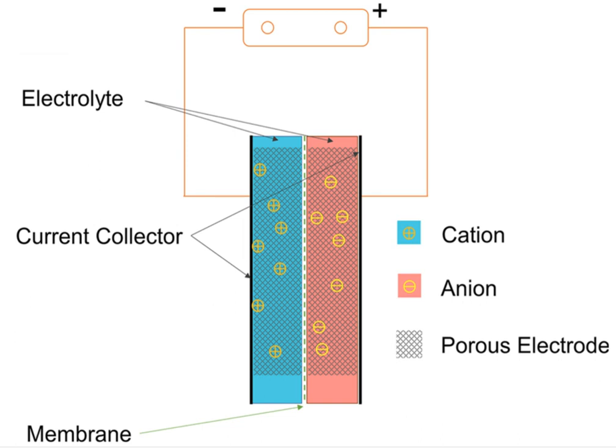Topic: Developments. As of 2013, commercially available lithium-ion supercapacitors offered the highest gravimetric specific energy to date, reaching 15 watt-hours per kilogram, 54 kilojoules per kilogram. Research focuses on improving specific energy, reducing internal resistance, expanding temperature range, increasing lifetimes and reducing costs. Projects include tailored pore-size electrodes, pseudocapacitive coating or doping materials and improved electrolytes.